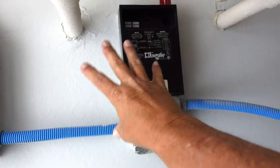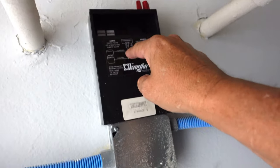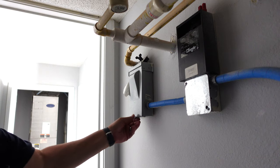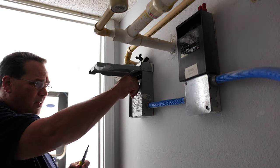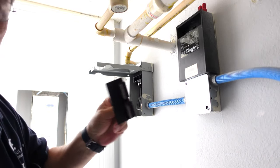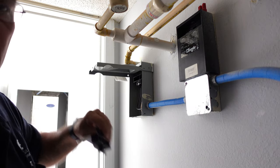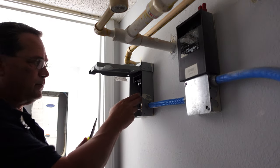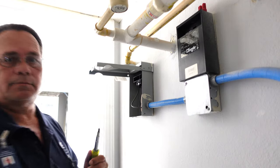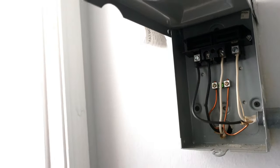I'm going to bypass this whole apparatus. With the way my pipes are right here, I might not be able to get to this piece to take it off the wall, but this one I can definitely take off. I have pulled the disconnect so there's no power going through this line. I'm going to identify what lines are here - the two outside lines, this one and this one - and go ahead and disconnect that.